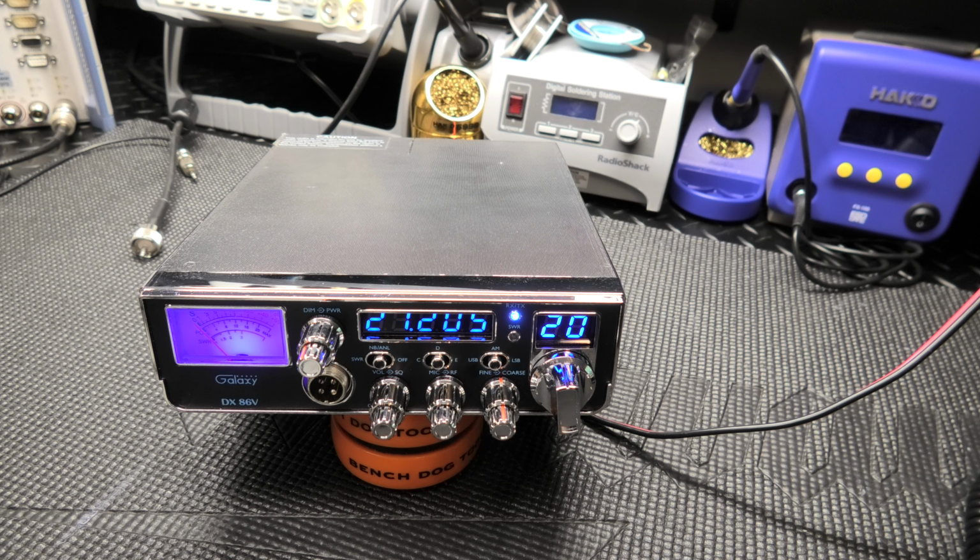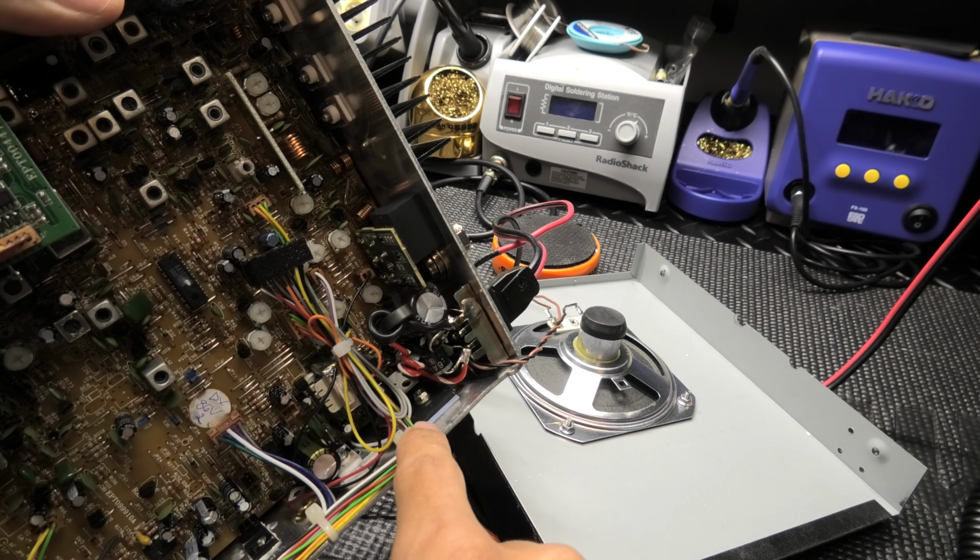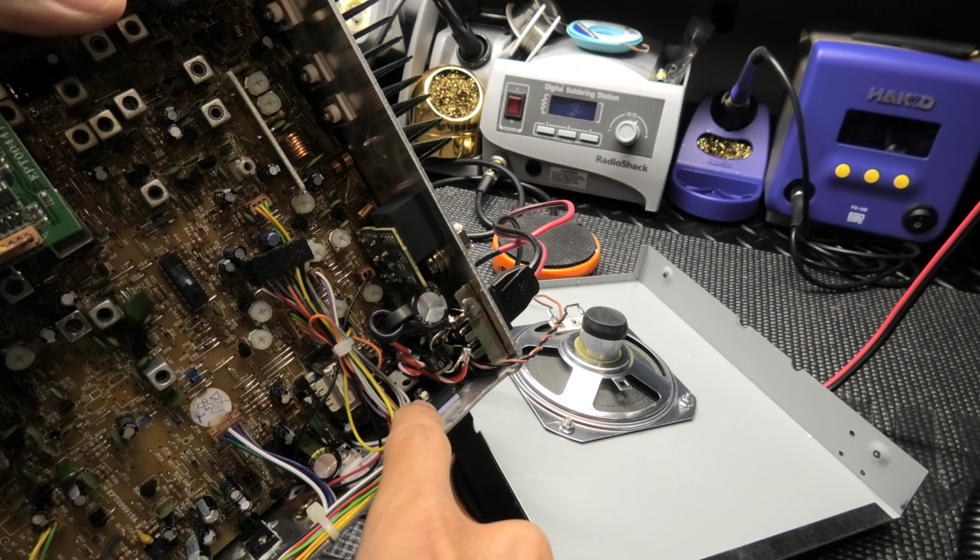So let's just get into it, and I'll just pop the cover quick, show you what we got going on inside. So you got a couple upgrades. Let me bring this a little bit closer. So you got the MD1. You got that zip tight here. It's not going anywhere. And then you got your DC main cap upgraded here. Your 8-volt regulator cap upgraded. You can see down in here, main modulation pass transistor voltage regulator upgraded here. This transistor upgraded, that transistor upgraded.